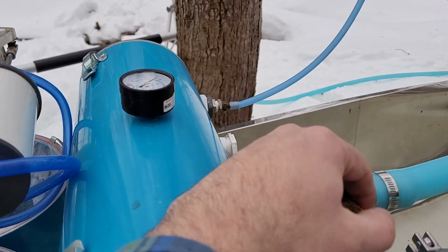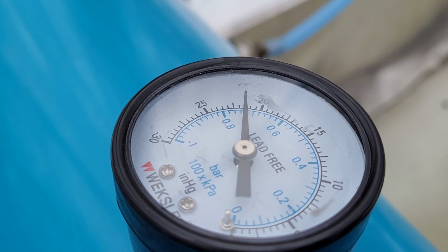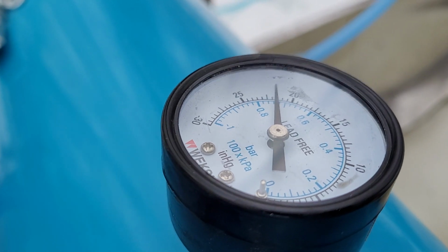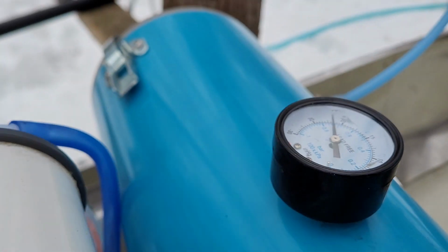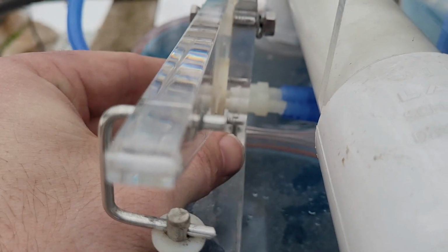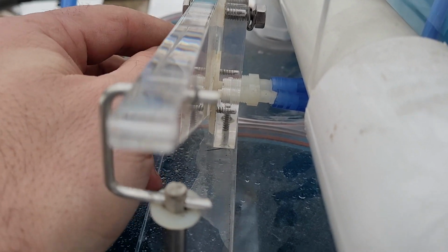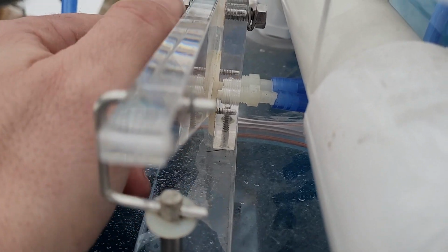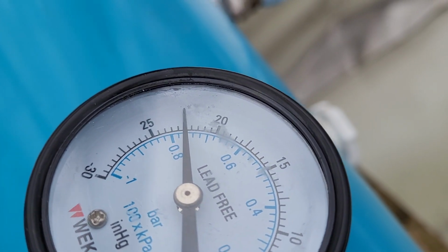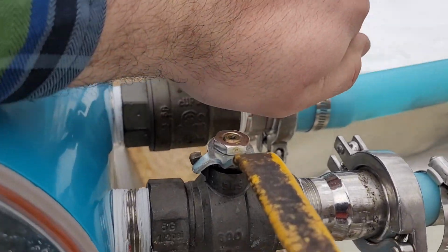It's still rising. So I'm going to turn this vacuum back on. It's still climbing. We got a leak right here. Right where that grease was. In the last episode I said, don't worry about greasing that. I'm talking to myself. It's almost up to 22.5. But here's the deal. When I open this valve, there should be no sound if there's no leaks. That's wind.